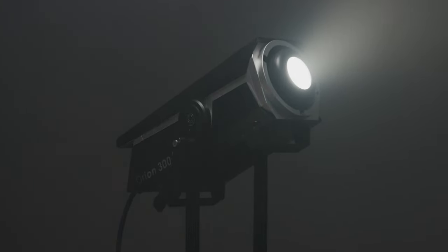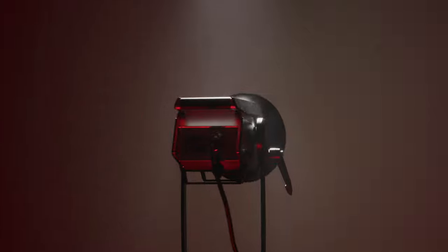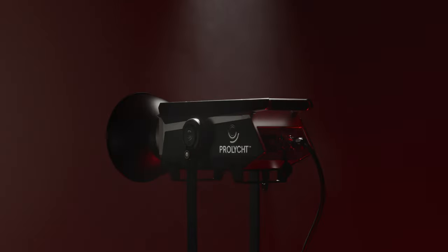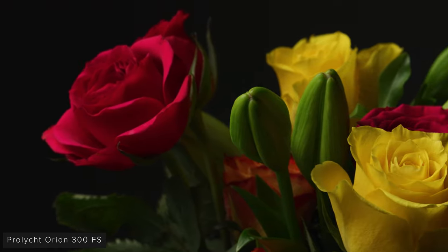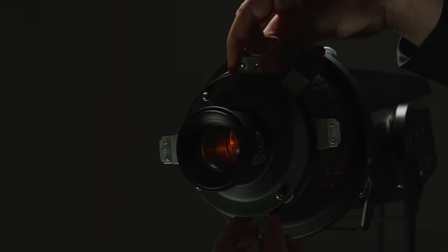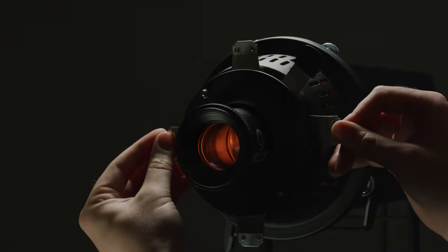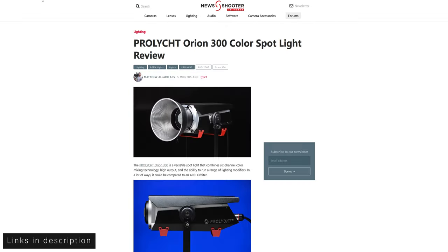So instead of relying on these white LEDs to produce their white light, Prolycht combine the six channels together to form white. This is similar to the technique that Arri have used with the Orbiter, and Prolycht have claimed that using this combination of LEDs allows the light to reproduce a much higher quality white light than other fixtures on the market, because you have greater control over the spectrum of the light being projected. We won't be going super in depth into the science behind this, but if you want to learn more about this, I've put some really good resources in the description below.